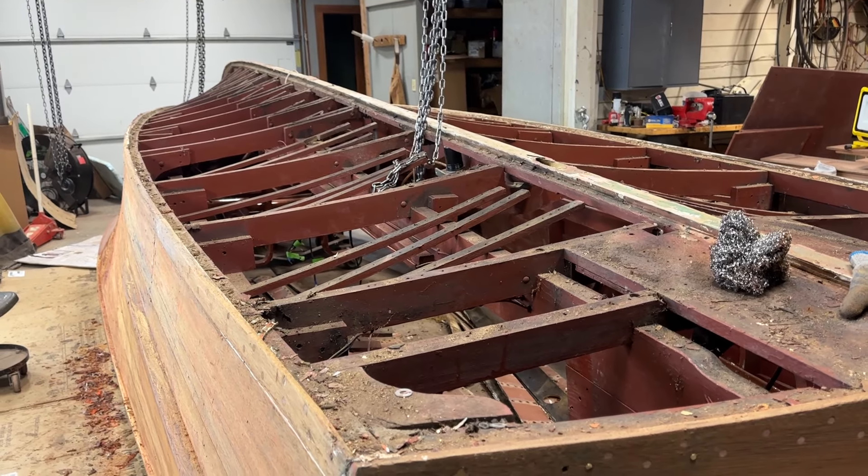So we've milled out all of the bottom planking. Once Rick has toothpicked the entire bottom of the boat and we've painted it with Chris Craft mahogany bilge paint, we'll be able to begin laying in her inner layer. And it won't be long after that that the longitudinal exterior planking — which is quarter-sawn FAS grade Philippine mahogany — will begin going on, bedded heavily in 3M5200. Everything will be sealed with four coats of CPES.